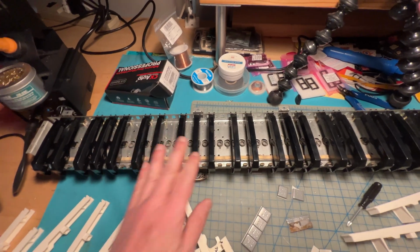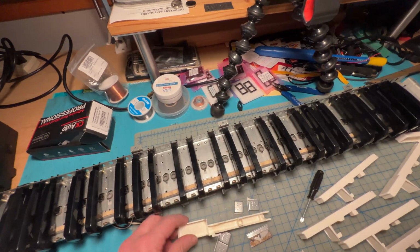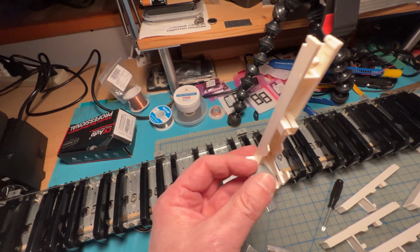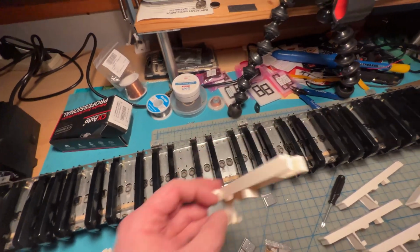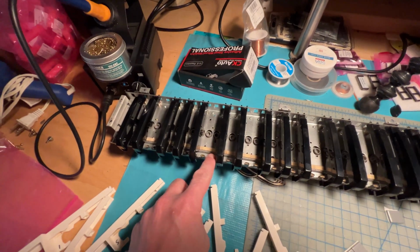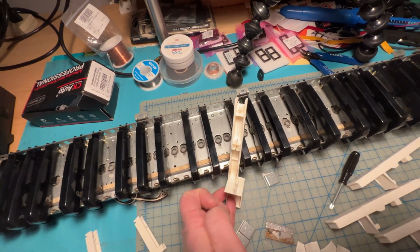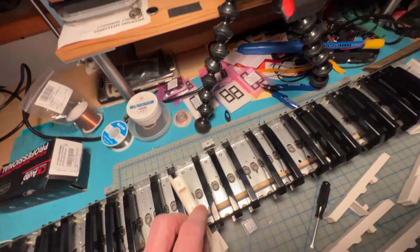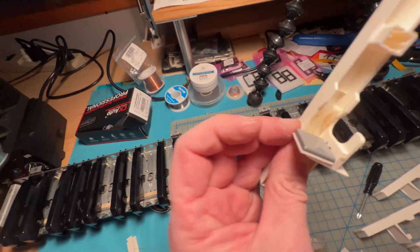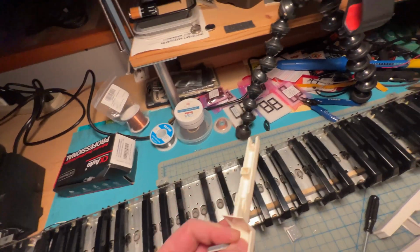The black keys are back in, and I've been agonizing a little bit as to where to put the weights on these guys, because originally I thought, hey, look how clever I am, I'm just gonna put it right here and it's perfect. And the problem is that between the E and the F key and the B and the C key, that space is not available. It's a lot more narrow. So the weight actually doesn't really fit. You see, it kind of sticks out. So that's a problem. And I could just switch it up for those keys.